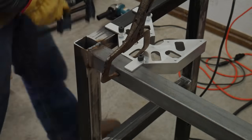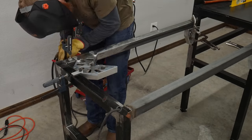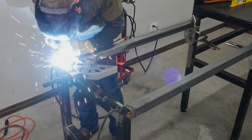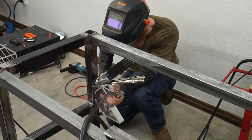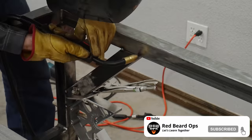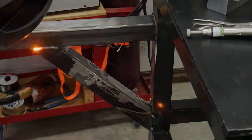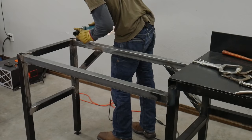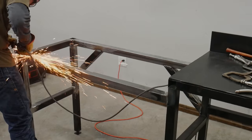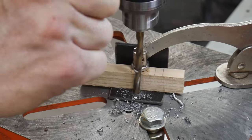For leveling, I clamped the Fireball squares in the X, Y, and Z axes so everything is nice and square, then got to welding the table up. Once all the welds were made on the new legs and cross bars, I wanted to add 45-degree struts in the back — gussets — to add rigidity to the lathe portion. In the old table I had one bar going all the way across the back, but I didn't have enough steel to duplicate that, so I used the angled gusset approach instead.